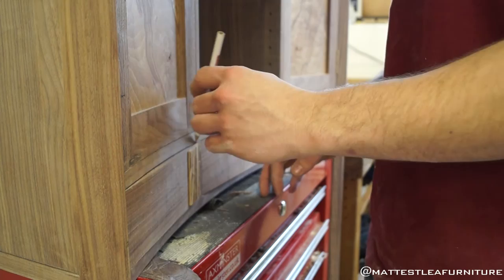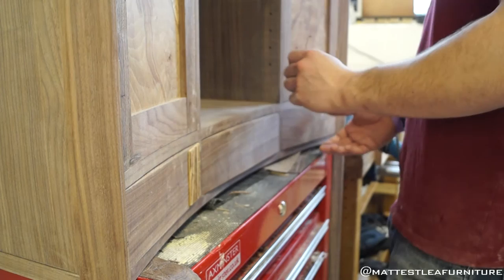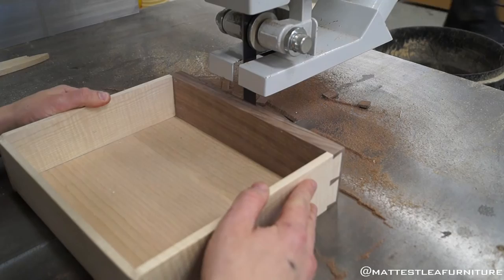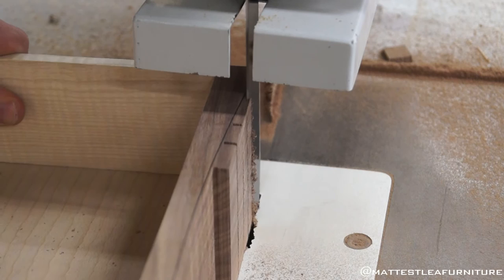Get all the corners flush with the cabinet and then draw a line all around it. I did actually quite like how they stuck out from the cabinet — it wouldn't have worked for this, but it's quite a cool effect I might use later on. Like using flat drawer fronts but in a curved carcass — it creates a different way of producing a finger hold.